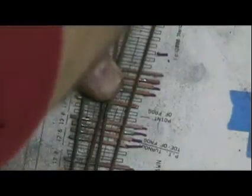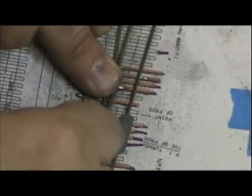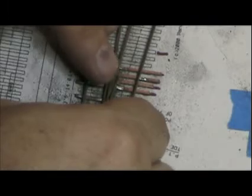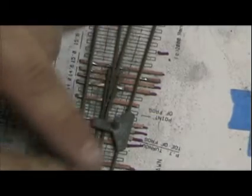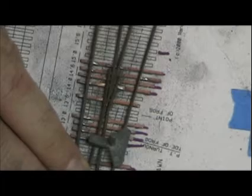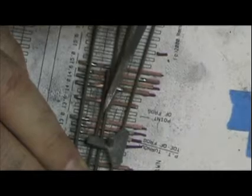Now let me take my little track gauges here, attach them onto here, and I'm going to try to slide this up as far as I can. The back of this track gauge is going to butt up against here, so you can't slide it too far, but I want to make my adjustments to get this all as tight as possible up in here. Because, again, like this rail here, you want a smooth continuous transition from this point here onto this closure rail.